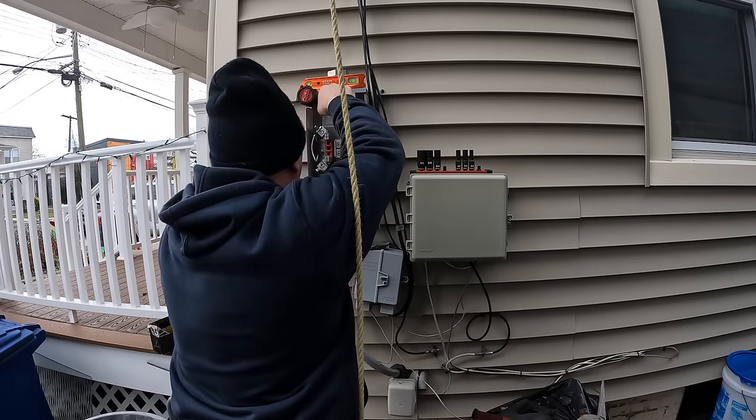Now I know in previous videos and around the YouTube circles here, you don't need to use antioxidant on service entrance cable in the modern day, okay? But here for JCP&L, and this also goes for PSE&G, so all you New Jersey electricians out there watching this video, both of those utility companies actually require that you put the antioxidant on the service entrance conductors inside their meters. So you don't have to do it inside the panel if you don't want to, but inside their meters, they specifically state, both JCP&L and PSE&G, that antioxidant must be used if you're using service entrance cables in any of their metering equipment.